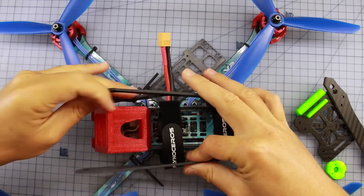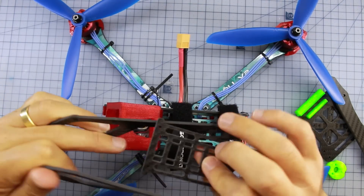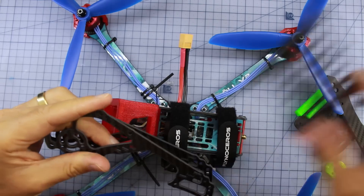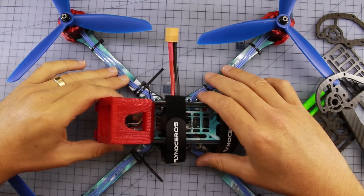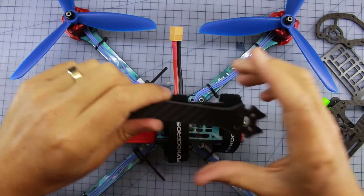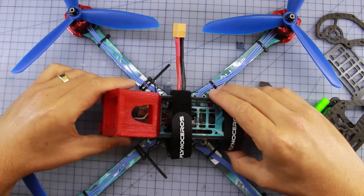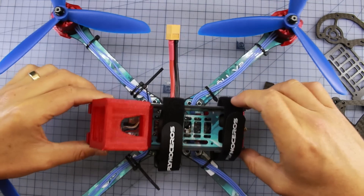You've got these two little three-millimeter plates either side that make up the bulk of everything in here. There are so many little ridges and options for zip-tying and putting different components in — this would be a fantastic rig to hook up to something like a ProSight or Connex long-range system for digital video. The TPU mounts are absolutely stellar; the quality of the carbon is very, very stiff, nice, and has been chamfered on the outside. You're getting one of the premium frames, around the hundred-dollar mark. I'm going to give quality about a nine out of ten.